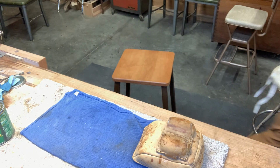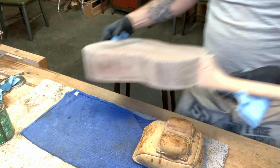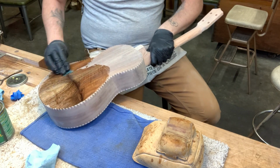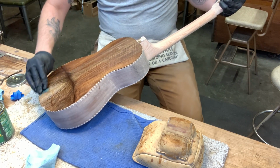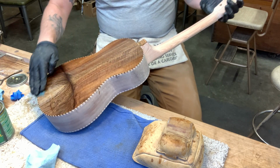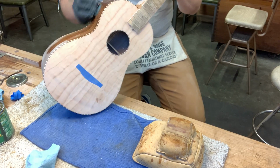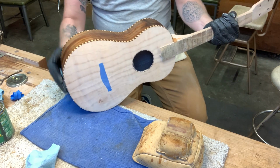So while I have the wet rag, I have another instrument to go into finish today. Might as well keep going. I have an old school oily rags container that these rags go into after they get used, so that we don't have a fire. I don't think Armor Seal has been known for spontaneous combustion, but anytime you use an oil finish, it could. And I am using mineral oil and linseed oil on furniture projects and spoons and cutting boards and other projects, so I got plenty of oily rags around.